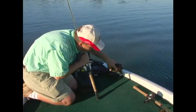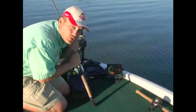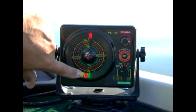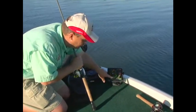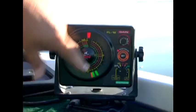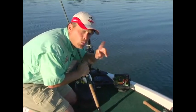First, when you turn the unit on, go to the 0-to-20-foot mode. It shows the bottom, so we're okay there. Keep the gain as low as possible. It looks like we're only in about 4 feet of water because that's where the first strong red signals are — but it's not, because you know you're fishing in heavy vegetation. The secret is to go to the 20-foot low power mode. It's built in, so it's just a matter of flipping the switch. Now in the 20-foot low power mode, I find out that the bottom is really in 10 feet of water. The green signals indicate weeds and other vegetation, but the true depth is actually 10 feet. The 20-foot low power mode cuts the output of the unit by 50%, giving you the ability to cut through all the clutter and show you what the true bottom is. If you're bass fishing and you find you're actually in 10 feet of water when most units say you're in 5, you have a distinct advantage over the competition.